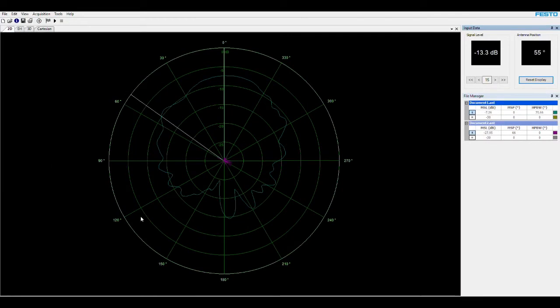Now we want to measure copole H-plane and everything has been set up. The most important thing to note here is that the H-plane for this antenna is much more directive than the E-plane. Comparing this to the dipole antenna measured earlier, the result is reversed — here H-plane is more directive. This is because the size of the antenna in the H-plane direction is larger than in the E-plane direction.